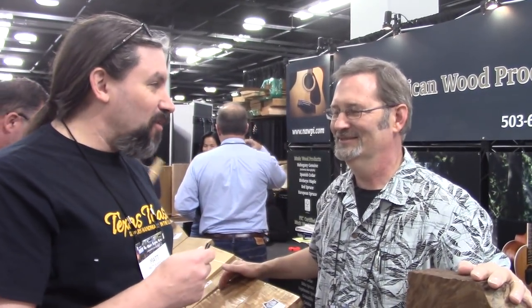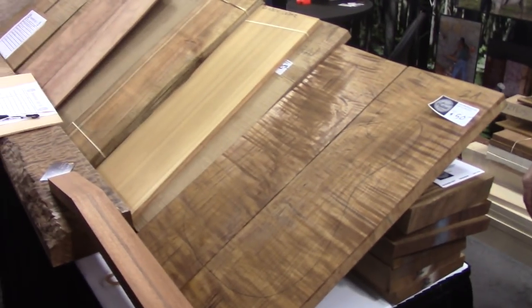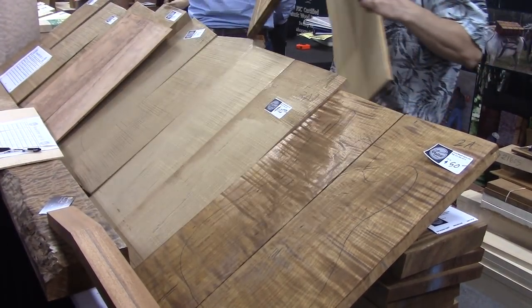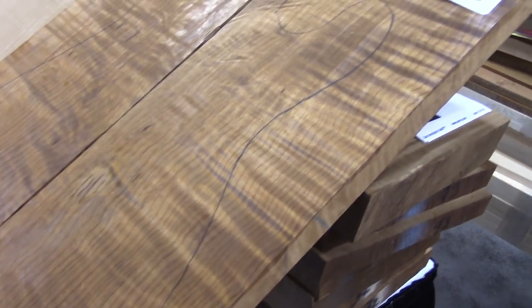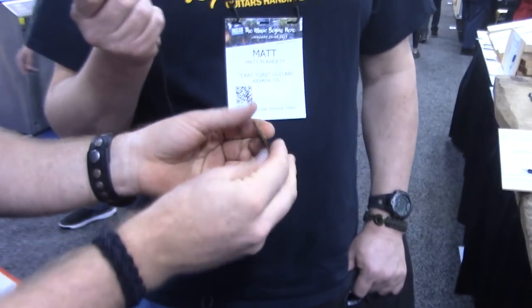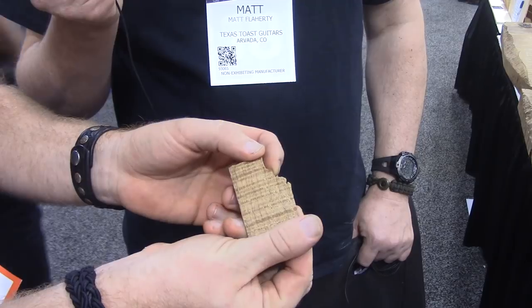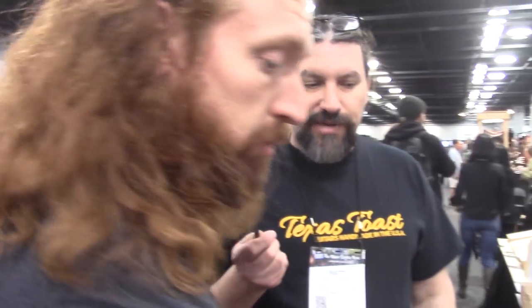All the roasted material from you guys has been neat, but fairly plain — this year you've got all kinds of stuff. Maple is a big item for the guitar building industry, it's a stable staple wood. When we roast the maple, the fibers crystallize and become incredibly shiny, adding depth you normally wouldn't get in flame and quilt. Here's a little piece off a 3A — if it wasn't roasted you wouldn't see it shine like that. There's no finish on this, I just broke it off a piece of wood.